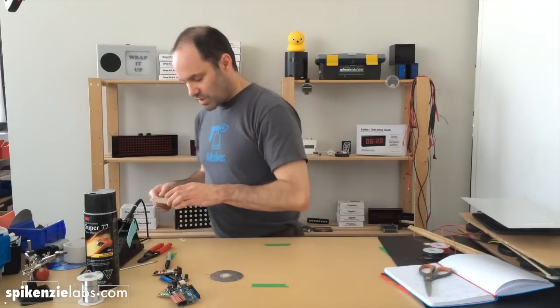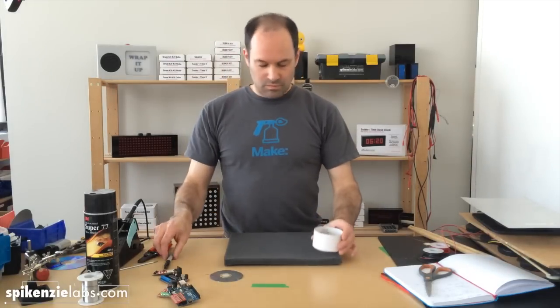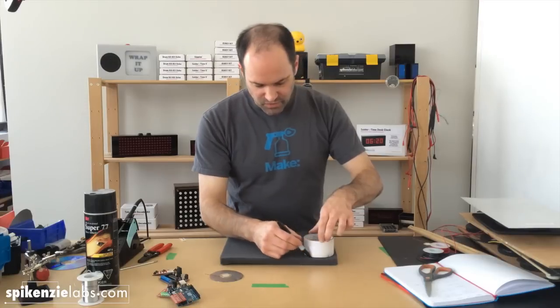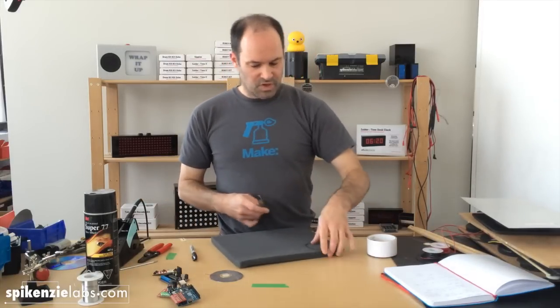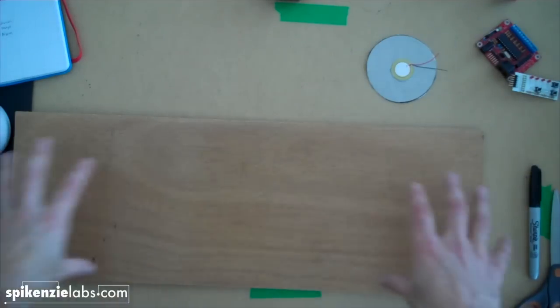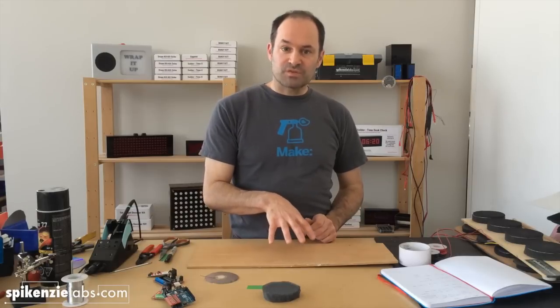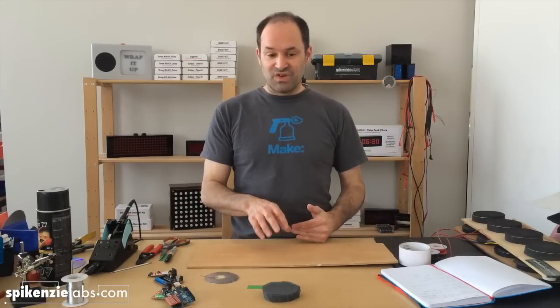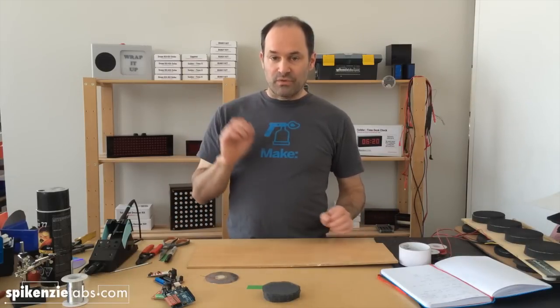We're going to take the same circle we used to draw the other parts and draw onto the foam. Sometimes this black foam is hard to see the line you've drawn, but it's okay — you can sort of make it up. We're going to cut this out. When you have multiple drum pads on one piece of wood, the stick strike from one drum pad will go into the piezo sensor of the next pad over, so you'll have to turn down the sensitivity. If you plan on using velocity sensitivity, I recommend making some sort of support and having the drum pads as independent as possible.